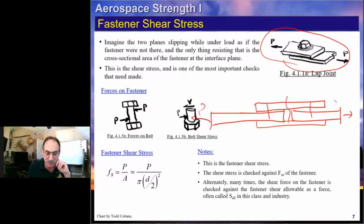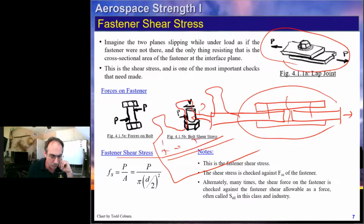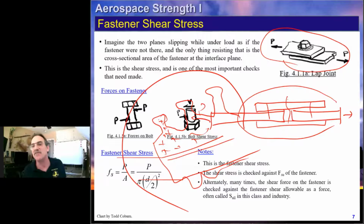At that time, we had splices like this, but even better, we had what's called a finger doubler. If you had two skins coming together, we'd put a splice plate, but with the splice plate, it looks like fingers of the splice. You've got two or three rows of fasteners here, and then fasteners going into this little finger, and then this bulbing out, and it'd be on both sides, like little frog fingers. This thing is amazing for fatigue. They last forever. And yet we're trying to be competitive, and we're switching to lap splices.